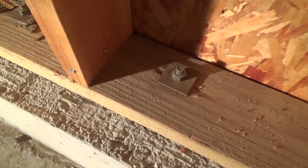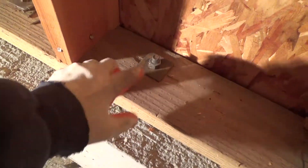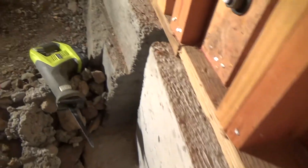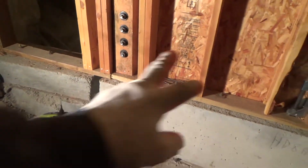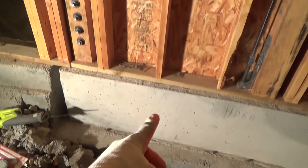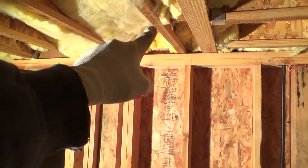I've made a decision — I'm going to take this foundation bolt out of here. I was tightening up all these foundation bolts anyway, and one didn't even have a nut on it. So I'm going to cut that one off. That way I don't have to notch the two-by-sixes I'm going to put down there. I'll cut two two-by-sixes, nail them together, put them down in that bay, and the weight will transfer properly.